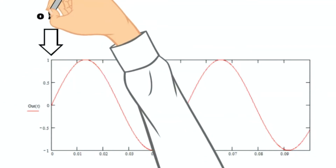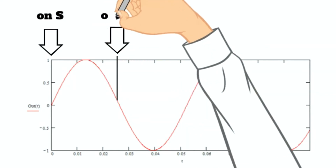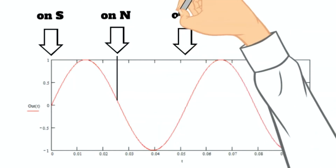To solve the problem of wasted energy, we want zero voltage whenever the poles are lined up — whether north-north, south-south, or north-south — because that alignment does nothing for us. We want maximum voltage when we're halfway between one magnet and the other. Well, if only there were a trigonometric function that would do that — it's the sine wave. When we're lined up, the sine wave is zero, and it peaks to 100% halfway between the magnets.